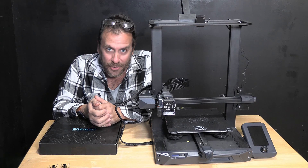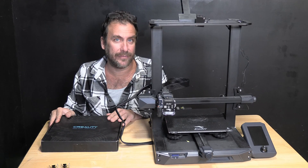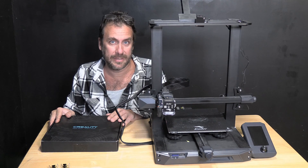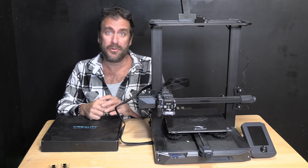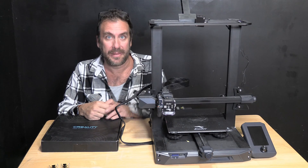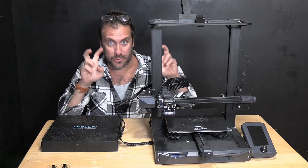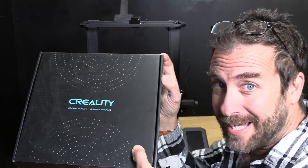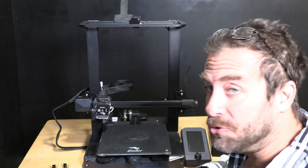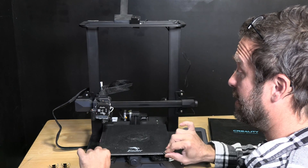So let's talk about how to go about replacing this magnetic bed with a glass bed. In front of me I have a Creality glass bed — it's 235 by 235. Keep in mind the S1 and the S1 Pro both use 235 by 235. Some of you confuse printable area with bed size. The bed size is 235; the printable area is 220 by 220. Here is my Creality glass bed. To get started, we are going to leave the printer off and pull it forward. You can move it by hand because your steppers are powered down. Simply grab the tabs and pick it up.